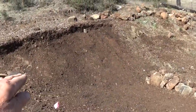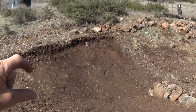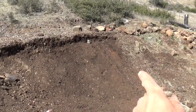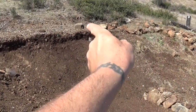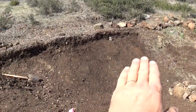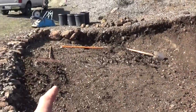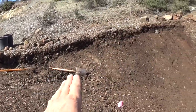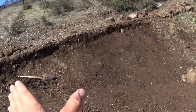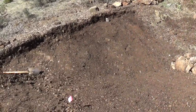And then instead of doing another terrace here, what we've decided to do is just clad it. So we'll do a bottom row of boulders and then on up and on up. This wall will actually be coming up more like this. I did a lot of cleaning up of the slope and evening it out in the background. But this will be like a pyramid of boulders in the background here. So this wall that you see will come over to that. This flat will come in here, and then the pyramid comes up, leaned back though. Instead of being a stacked wall, it'll be leaned back.